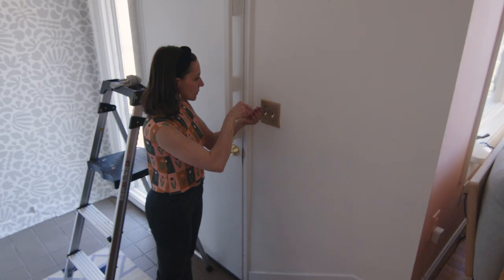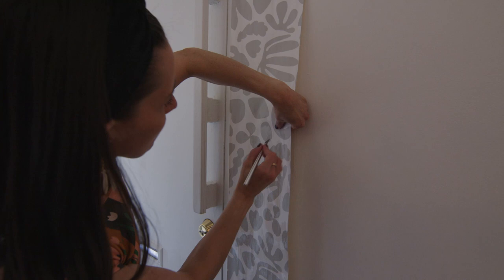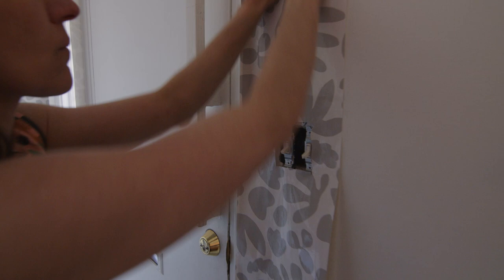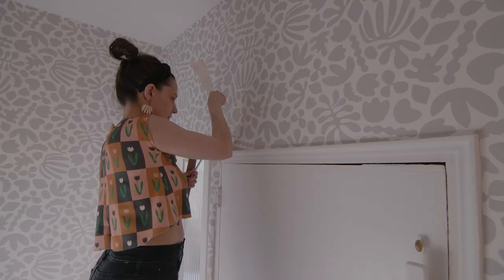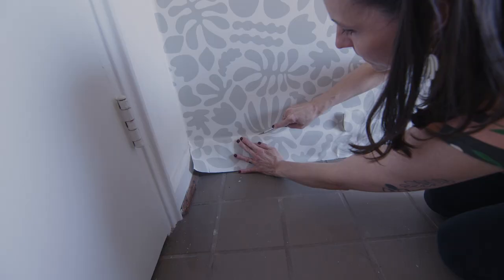Now we have a light switch. Remove the cover plate and switch off the power. Have your X-Acto knife and scissors ready. Once you get to the light switches, find where they fall on the paper and make a little cut with your X-Acto knife. Use your scissors to cut out an opening — you just need it to be big enough for the holes to show where you will screw the cover plate back on. I usually freehand the trimming, but I recommend using a metal ruler or straight edge as a guide for your X-Acto knife for a perfectly straight cut. Replace the blades often as you go along — they dull quite easily during this process.